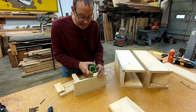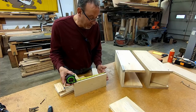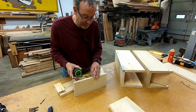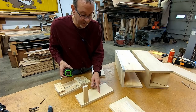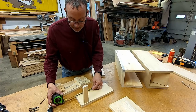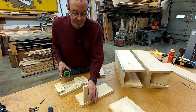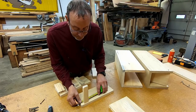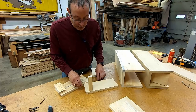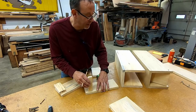I'm not sure if that's dead center, but we're going to give you some dimensions here. From the actual bait trap end, it's going to be 6 inches exactly to the center of this hole. So 6 inches, and then whatever remainder is, it's going to be about 6 9/16. The placement of, it's going to be 1 inch in from the end here. And you're just going to hold it over a little bit, 1/8 inch, so it don't drag the sides of